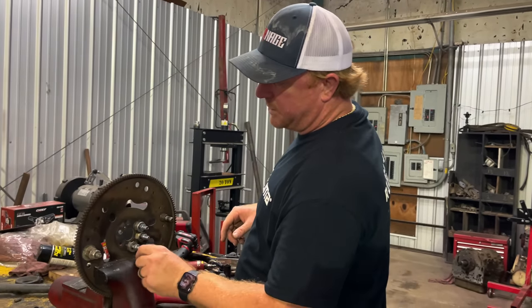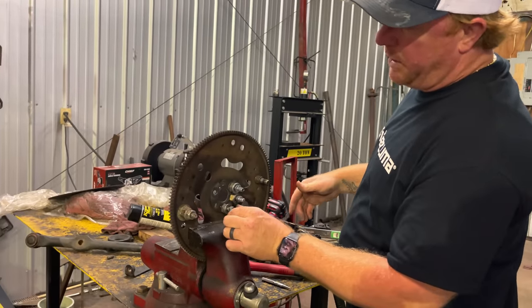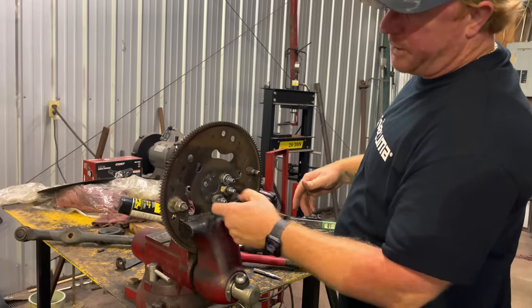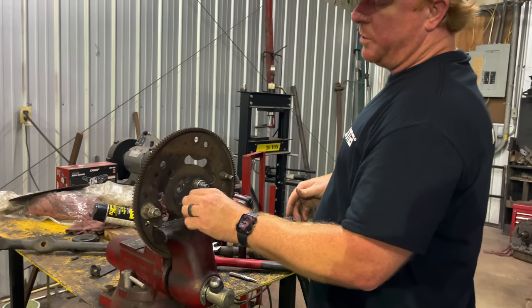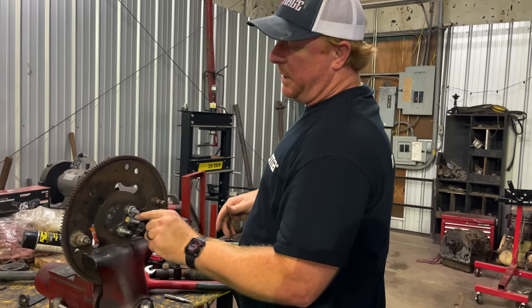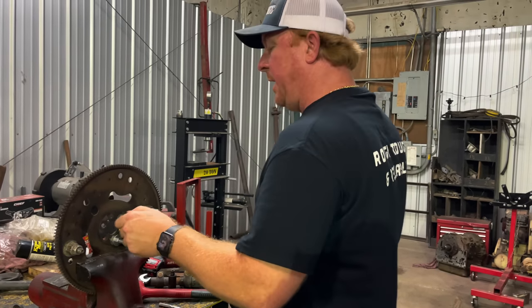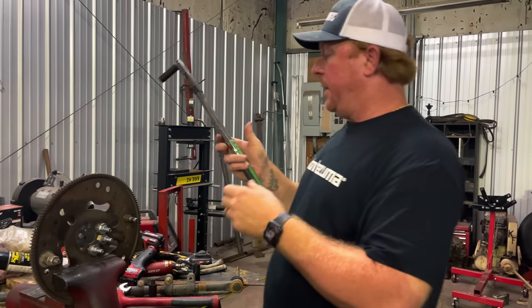What I've got here is just a bolt welded from the backside on this old flywheel plate, and I just put a spacer in there with a washer. I'm going to run these down hand tight. We'll torque them to 50, 60, and this one will be at 70. And if it can do it, then we'll move to a larger bolt and see what we can get out of it.